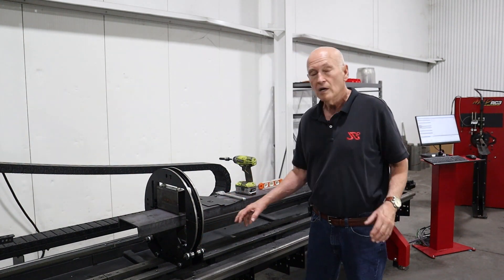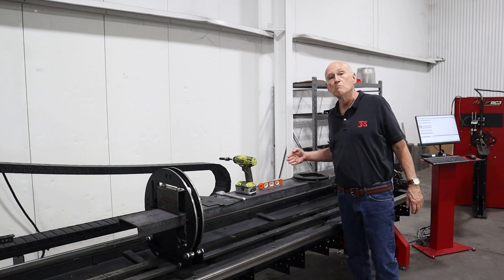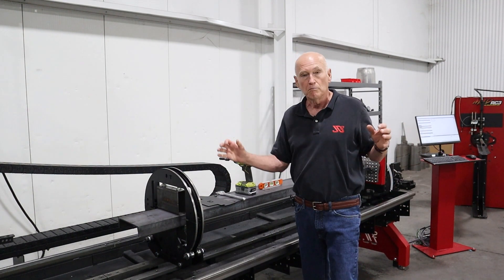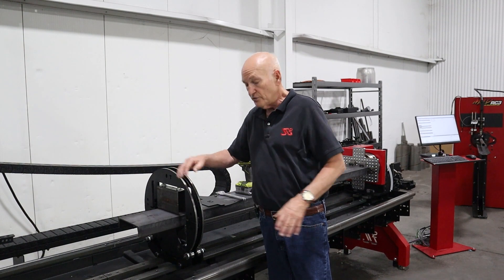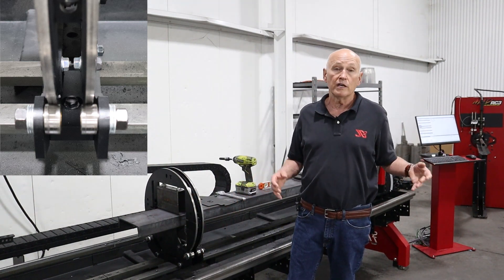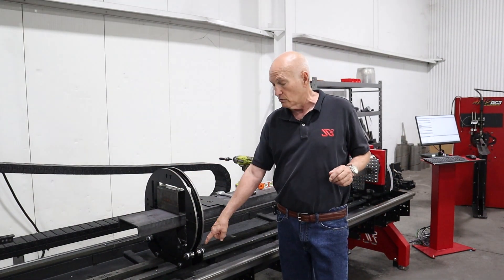The best place to start is the roller base itself right here. It has been precision machined so that when you install it into the machine using two 12-millimeter bolts, it is going to be precision located right in the middle of the axis. You don't have to worry about trying to line it — you literally drop it on the frame rail wherever you want the ring adapter system to be positioned on your workpiece, bolt it down, and away you go. When you load the ring system onto the roller base, you want to eyeball it in the middle of the cam followers. We've allowed about a fifth of an inch — 200 thousandths, or 5 millimeters — which will allow you to easily eyeball it into the middle.